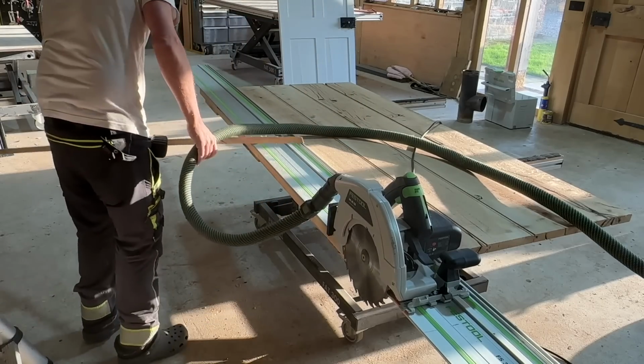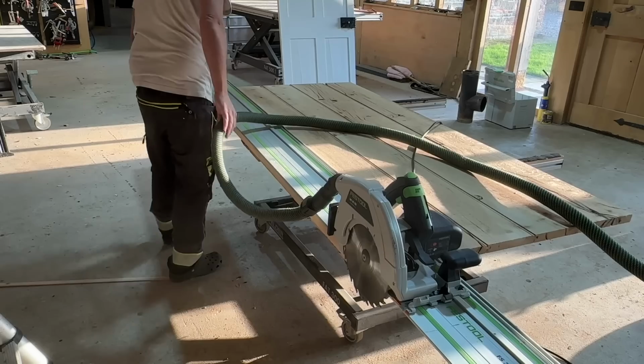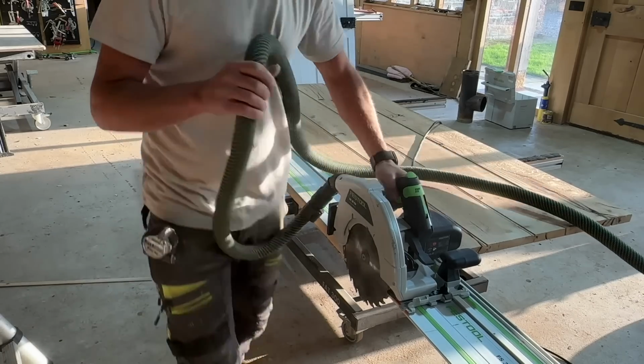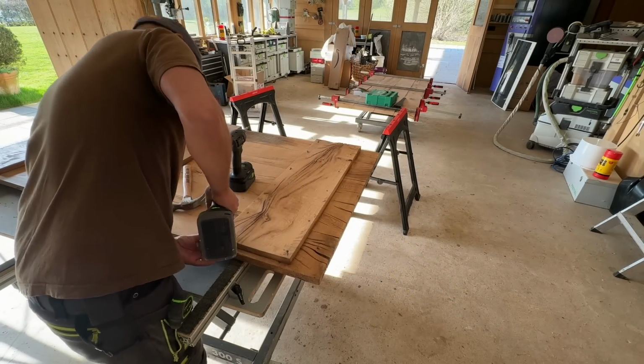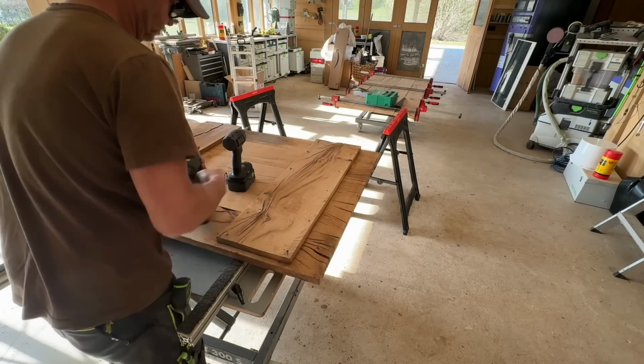So nothing is straight in these old houses in the UK. My house is a 17th century old farmhouse. So the best way is to make the door slightly over dimensions and then cut it to match the existing old frame.